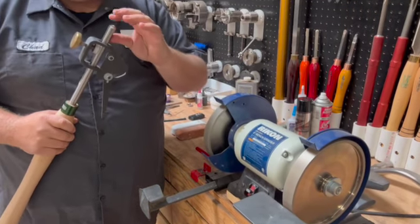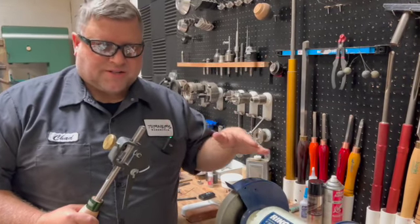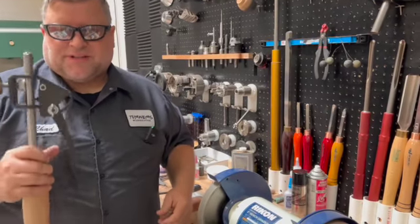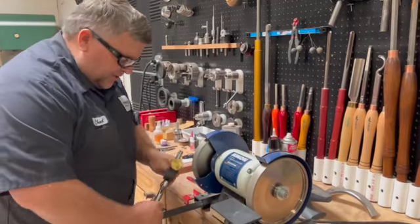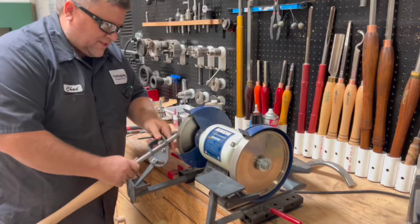Now, once this is to my 50 degrees, when I go to sharpen it, it'll take just one pass to be sharp. So one side, and then complete, and that's it. So this one is taking a little more because it's the first one going from 45 to 50 degrees. But even there, you can see how relatively quick this is.